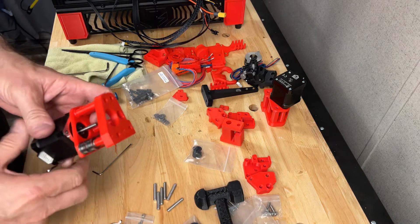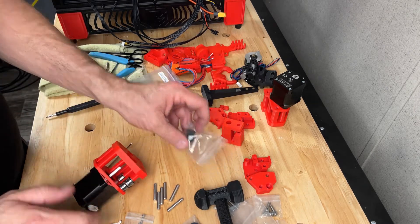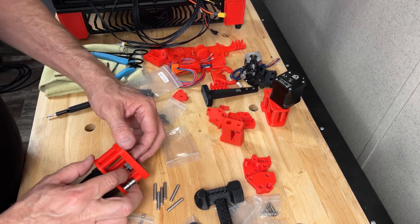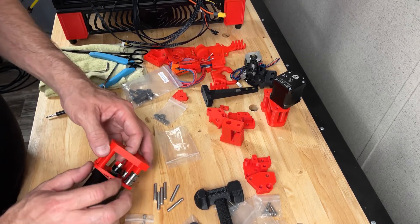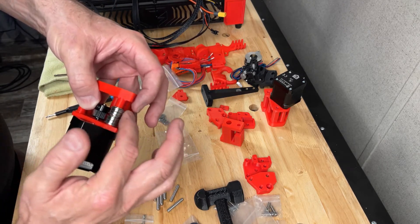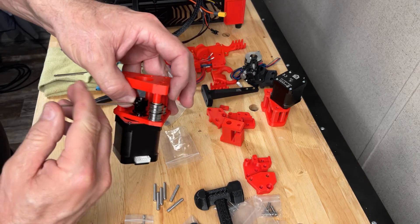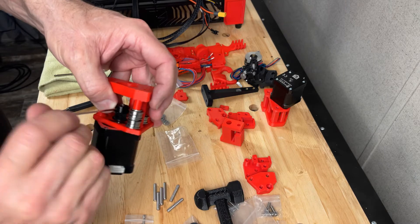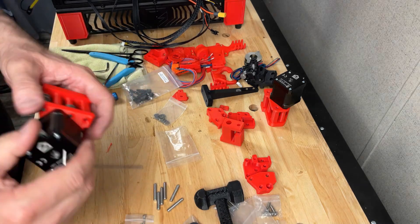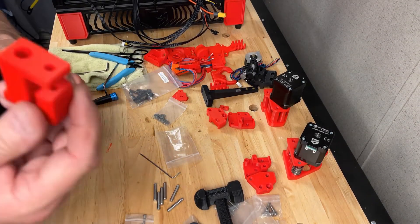You don't need to get carried away with tightening those down. Now on this one, the pulley will go the opposite direction - it will actually go with the teeth closer to the stepper motor. Same as before, you kind of want that to line up with the double stack, or the double bearings. This right here is just an idler where a belt passes around this stepper. Just get it lined up and snug them up for now, just more or less to hold them in place. Then once we actually assemble it onto the printer, we'll get those more adjusted. Now we'll do the front stepper towers - these are a little bit fiddly to do and I'll show you why.